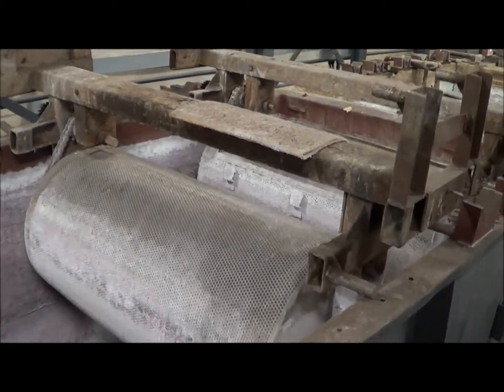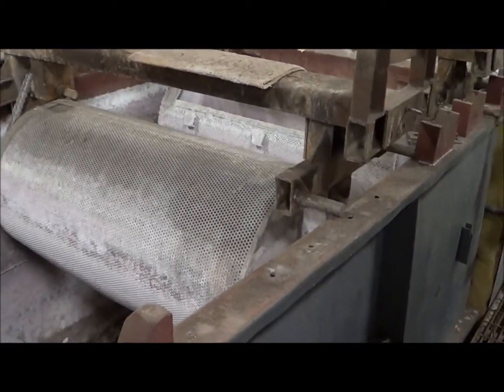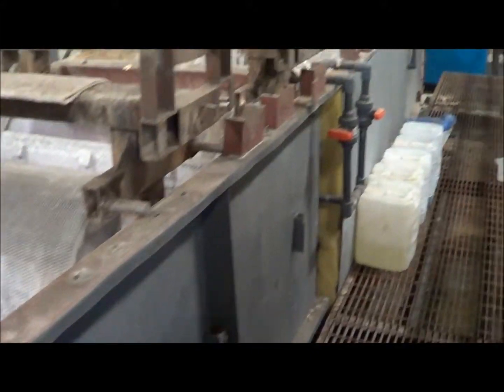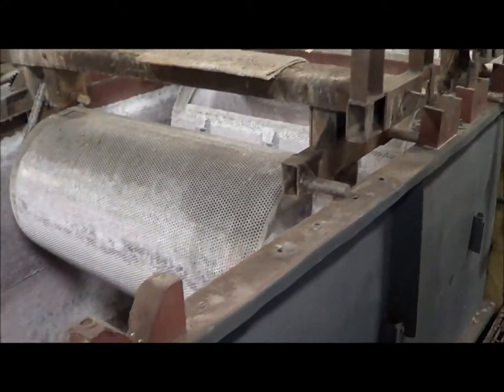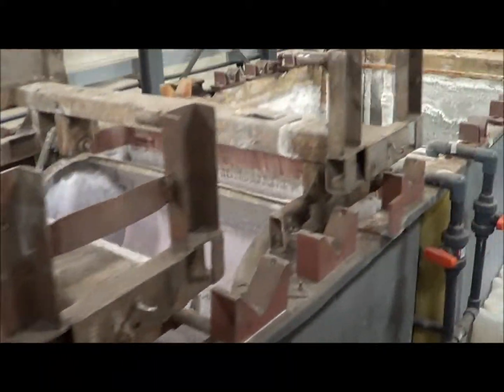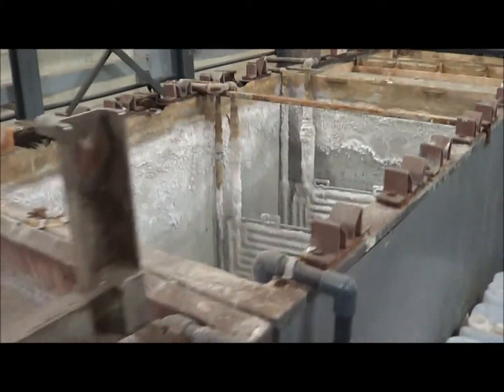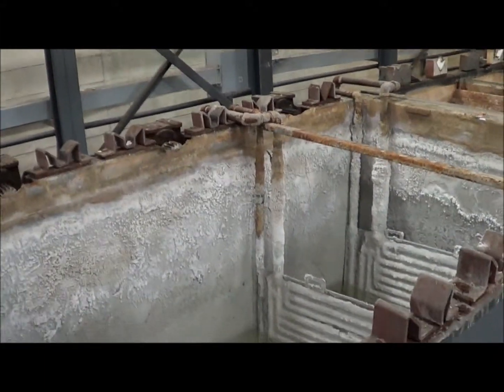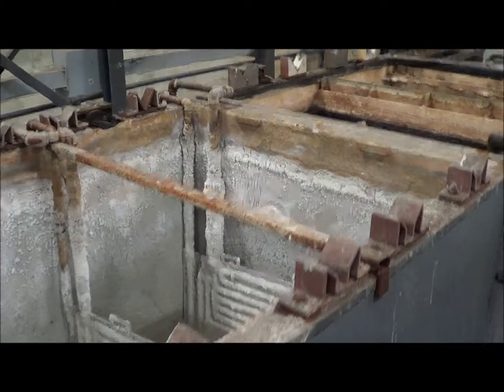There's a phosphate rinse, and then two three-station phosphate tanks which are stainless steel. The second one is jacketed, the first one is not jacketed, but they're both three-station stainless steel tanks. They're just in the process of steam cleaning the machine and pumping out the solutions.